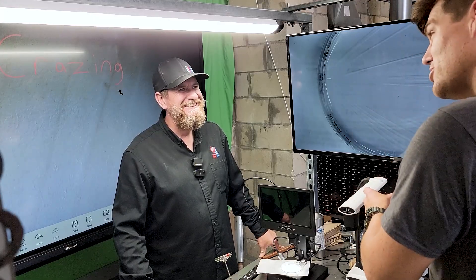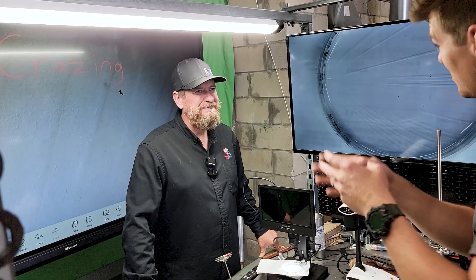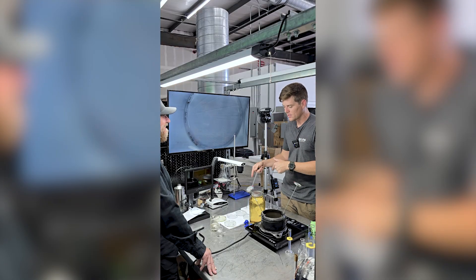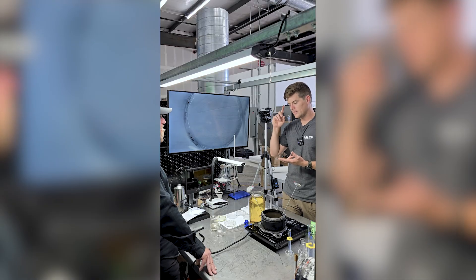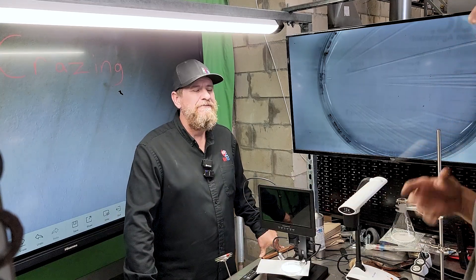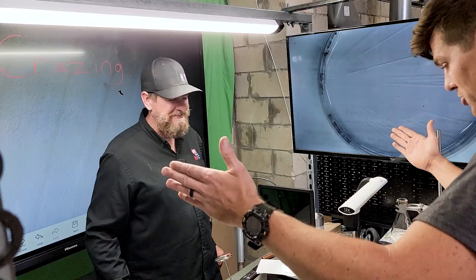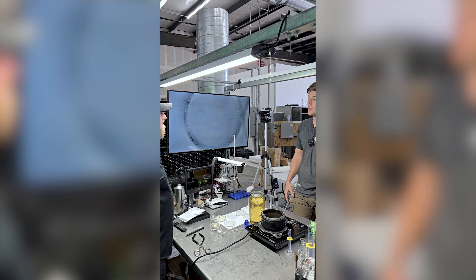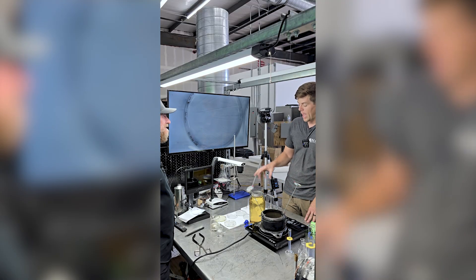At the cost of cleaning expansion valves, I'm now spraying acid all over my coil. The chemicals in that specific rust inhibitor also eat copper, and now I'm creating leaks. How many times are we doing all these things without understanding the actual consequences? The degreaser is one of those things where you've got to make sure it's safe for rubber roofs, safe for aluminum or copper, and you need to consider the screws holding the rooftop unit down. You can't just go spraying an acid or a base without understanding that you literally have to hose everything down with water to dilute it.